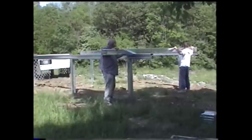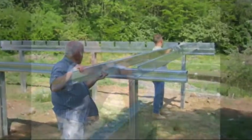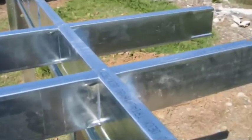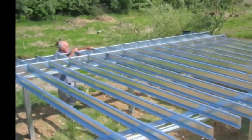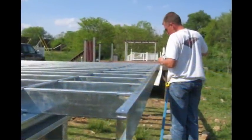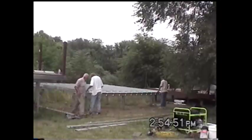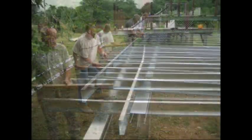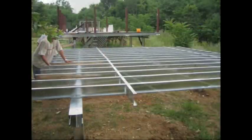Once the beam bridge is mechanically fastened to the beam, the deck joists are installed. Each Deck-on-Steel joist has been manufactured to a precise length, so no measuring or cutting is required. Joists are also labeled for easy identification. Once all the deck joists are in place, the rim joists on the opposite end of the deck frame are installed, fitting accurately into place and fastened in pre-drilled holes. Deck-on-Steel's mid-span bridging, made like a beam bridge, creates a continuous structural connection through the middle of the structure, closely replicating the structural properties of a diaphragm, which makes Deck-on-Steel structures stronger than their wood counterparts.